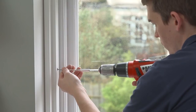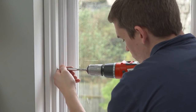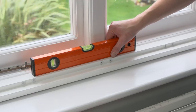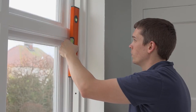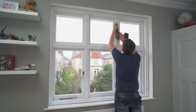If you are drilling into wood or a stud wall, take these long screws and drill two or three screws to get the frame fixed to the window. Use your spirit level to get the frame in the right position. Make absolutely sure that your frame is level on the bottom and the upright sections of frame are straight. Then add another one or two screws so you have one screw inserted for each side of your frame.